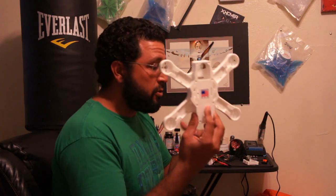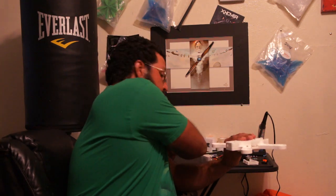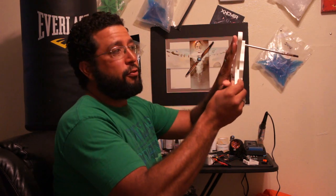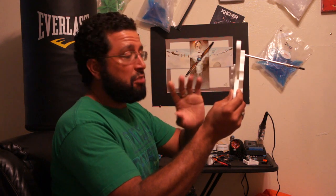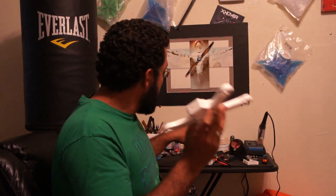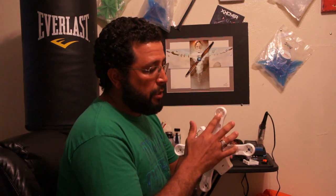Carbon fiber blocks your radio frequency waves because it conducts. Look, there are hundreds of other videos you can find on that; I'm not going to get into it. But when your frame, say this is my little VTX antenna, normally it doesn't wobble like that. When you do a roll or whatnot, your signal's being blocked by your frame via carbon fiber conducting electricity. This bad boy? No. Not at all. Radio frequencies go right through it. Less likely to failsafe, drop video, etc. Awesomeness.